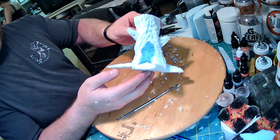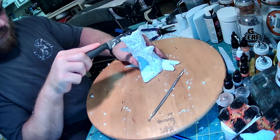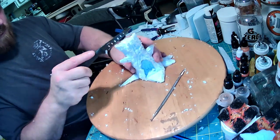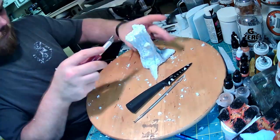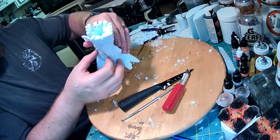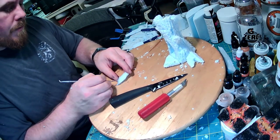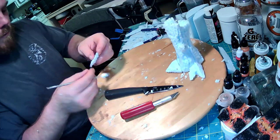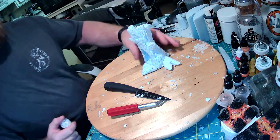All right, this is what we've got so far — it's starting to look pretty good. With those lines dragged from top to bottom, I'm going to cut little wedges out with a knife just to really define and exaggerate them, make them pop, and break down some of the squareness on top so it looks more organic. I continue making sure the door always fits, and you've got to make sure you do the lines down the front of the door as well. Try to get them to line up with the ones on the front face, or just do them randomly — they'll still look really cool.